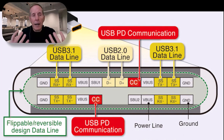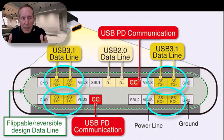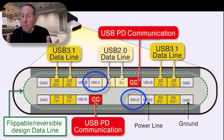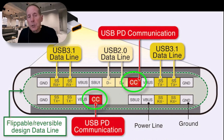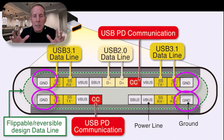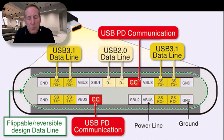Here we have a picture of the actual pinout of a USB-C connector. We can see four differential signal pairs — that's what gives us our 40 gigabits per second. We also see the D-minus and D-plus, which are the old backward compatibility pins for USB 2.0. SBU1 and SBU2 are called sideband use and are dedicated for alternate mode, really for Thunderbolt. The CC pins in red are used for configuration to determine which way the connection is flipped when plugged in, and also for power distribution. The V-Bus pins are probably the largest wires in the cable and deliver high current at whatever voltage is required. This layout is designed to provide the least amount of crosstalk, reducing EMI, and providing maximum isolation between all signals being transmitted and received.